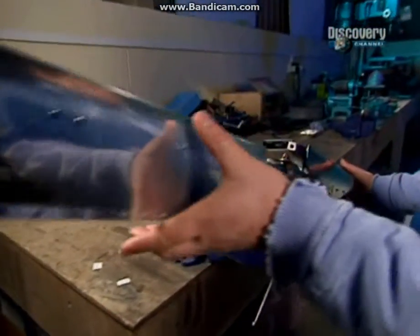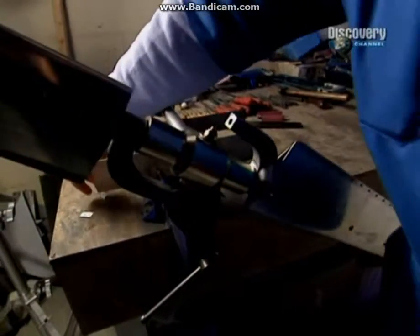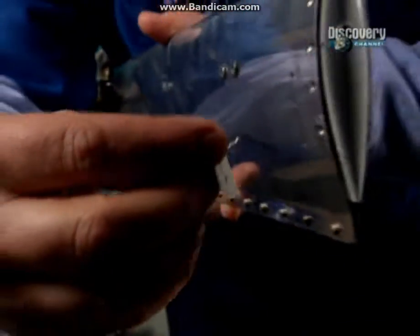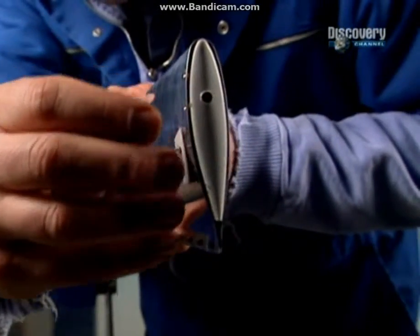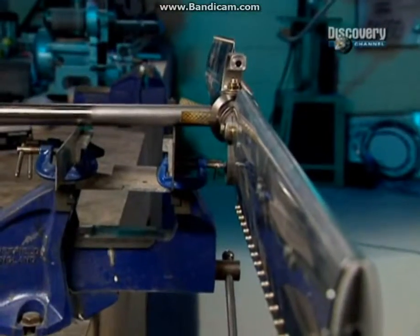And what happens is it drops down slightly this side, which obviously means this side is too heavy. So I've got some different pieces of aluminium here, different sizes, so obviously different weights, and then I can play with it and trim them down until I've got the perfect piece. Once I've decided exactly what weight it is, then we can fix that on the inside for good. Just make sure we're not touching anything. See what happens now. First time lucky. That is looking like a job in the town.